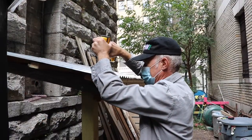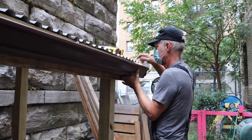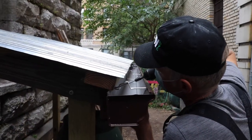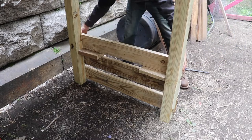The metal is connected using special screws that have seals which prevent any leaking. The final step for the roof is attaching the metal gutter. We used 2x6 pieces to tie the posts together and make sure that the structure doesn't wobble when pushed or move during storms.